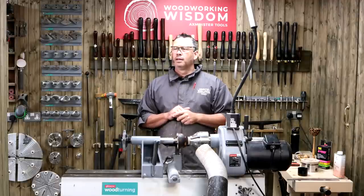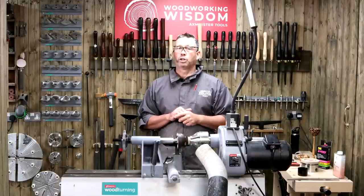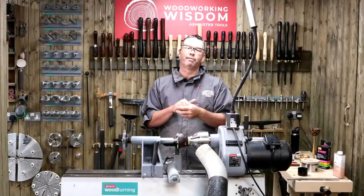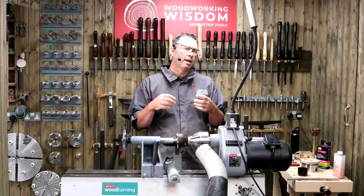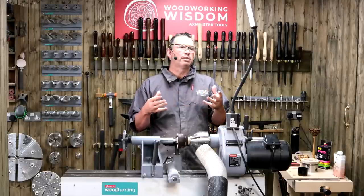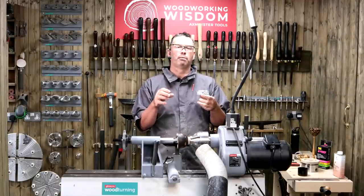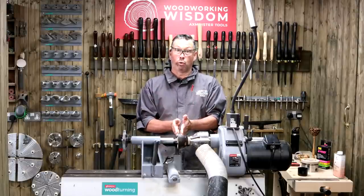Yes, Ben. And Paul says, hi, Colwin. Can you only turn small boxes from spindle blanks, or will small bowl blanks and timber planks work? Absolutely. The resin is the strength in this. And now I've spoken to you about this before in terms of types of resin. And we know that epoxy resin has structurally the strongest bond on timber, whereas things like polyester resin, for instance, wouldn't have a very strong bond. So no good for river tables, that sort of thing, and this sort of project either.